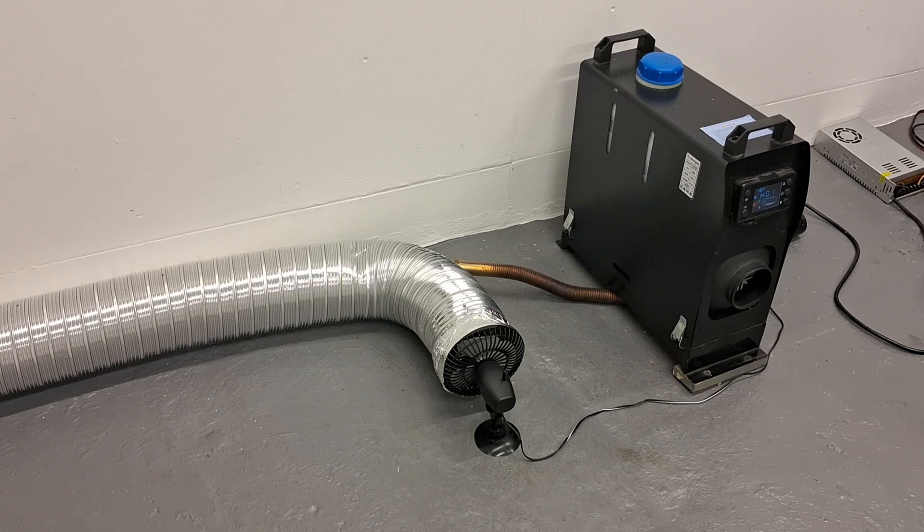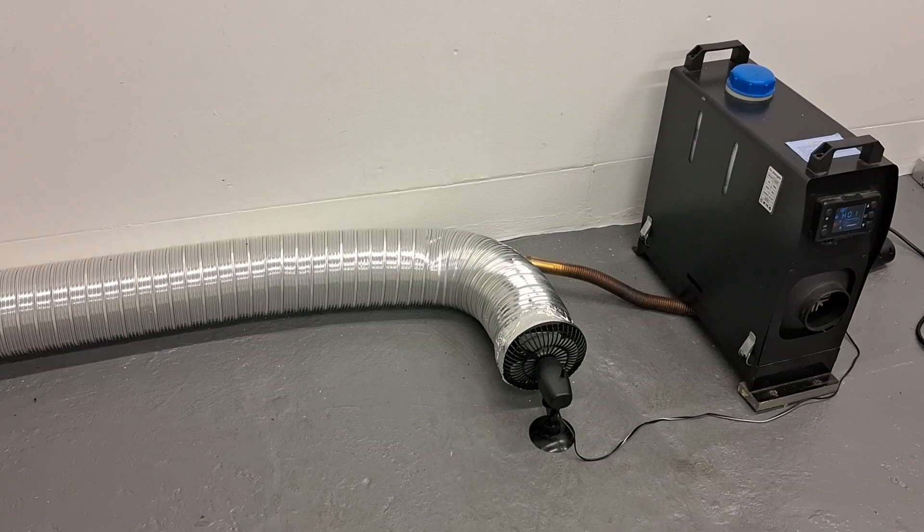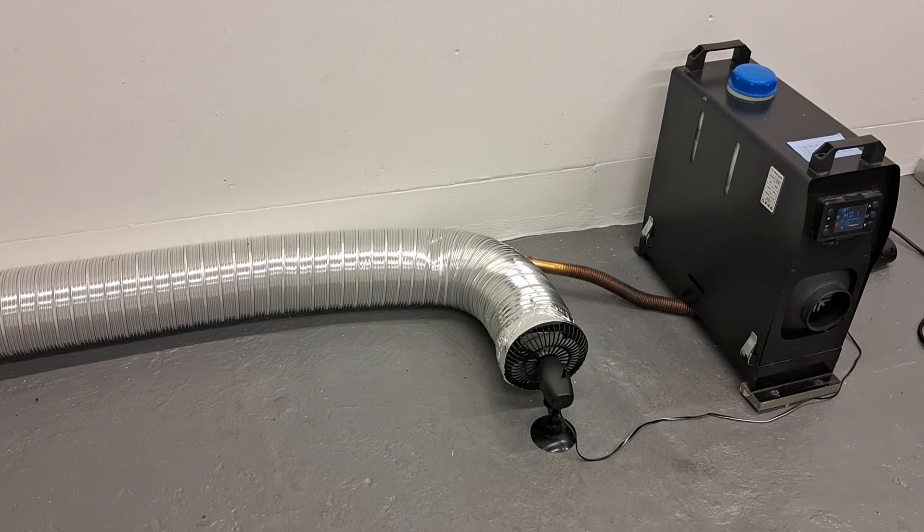Maybe the most important thing I found doing this small experiment is that it would be very important to have a variable speed fan. This is so that we could adjust the fan speed to take the maximum amount of heat from the exhaust pipe out of the tube without blowing it too fast. Also, with the fan going too fast it's probably going to be too noisy — in this situation the fan going too fast is too noisy.